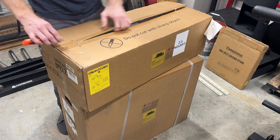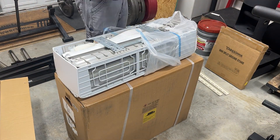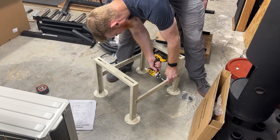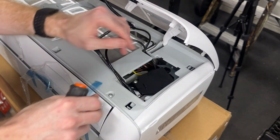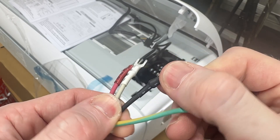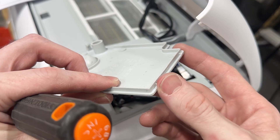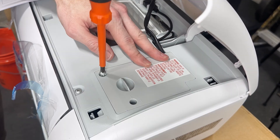This is basically the cheapest mini split I could find on Amazon, so I won't be expecting many frills — no cardboard cutout templates or detailed instruction manuals, but you'll have everything you need. This adjustable stand is purchased separately and I get it set to the right length early so it doesn't slow me down during install. Before mounting the interior unit it needs to be wired up: remove the access panels, feed the control whip through the back, connect each wire to the corresponding labeled terminal for the ground, 3S, 2, and 1. One thing I noticed is that the plastic tabs in the cover were broken, so I put a piece of tape across the top to hold it flush.